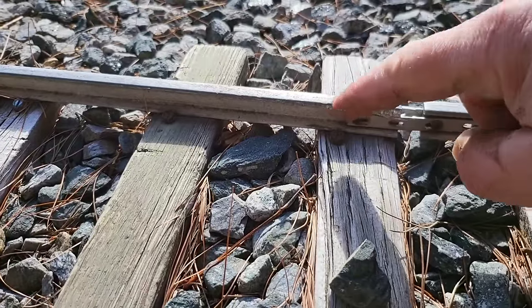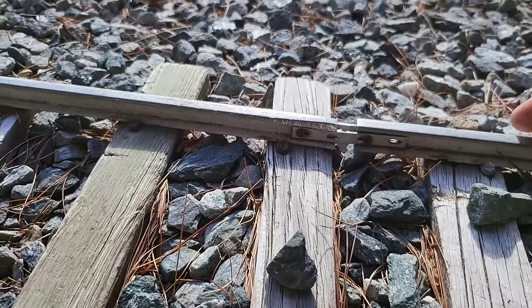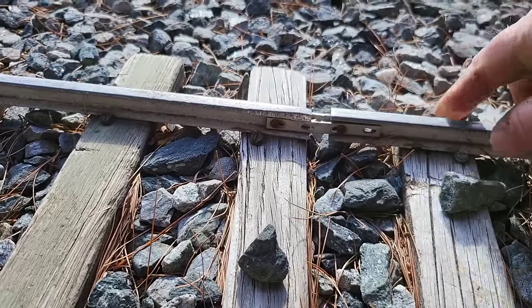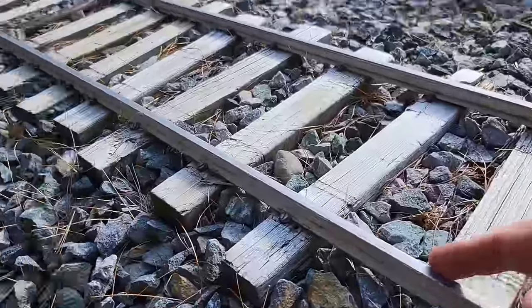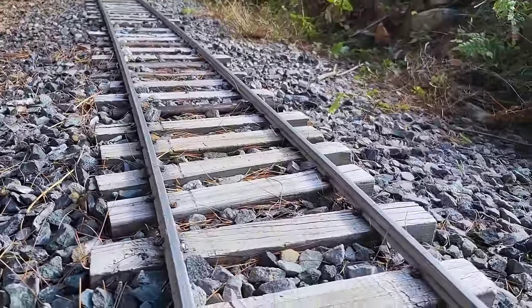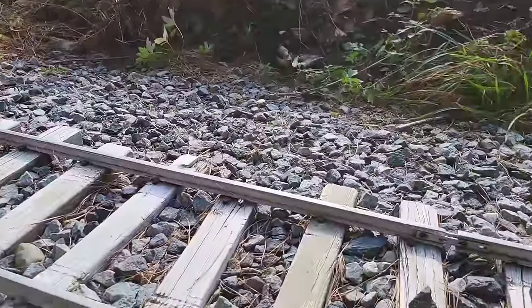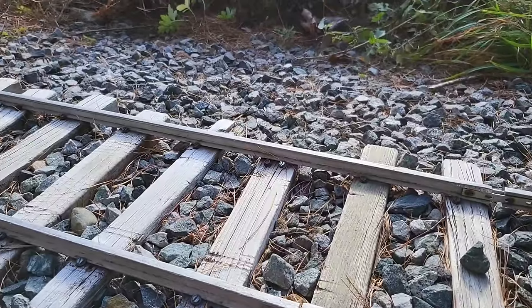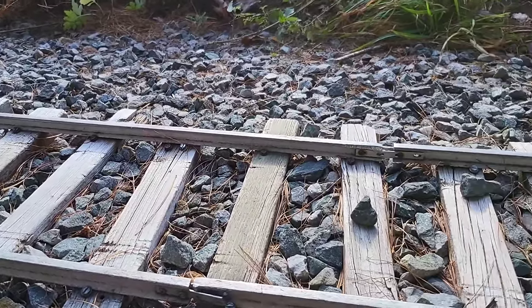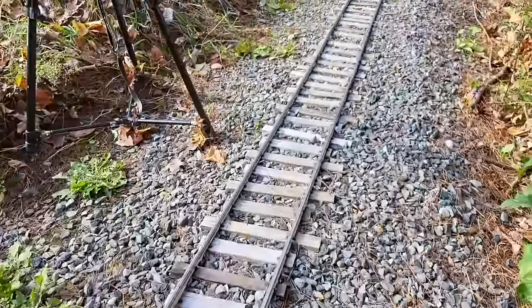But this is even worse. This is my target today. This rail, maybe not quite so bad, but this one, definitely bad. This one's got a bend in it, a curve in it from too many derailments. So they're both going to be replaced, so the geometry of the track will be a little nicer through here. And if I have time, I'll get to these right here.